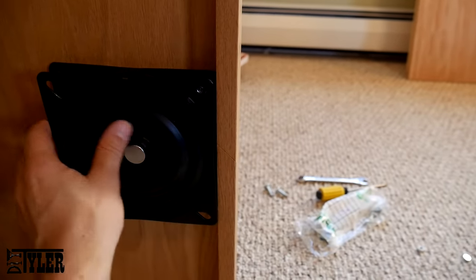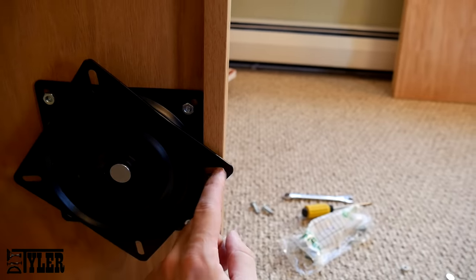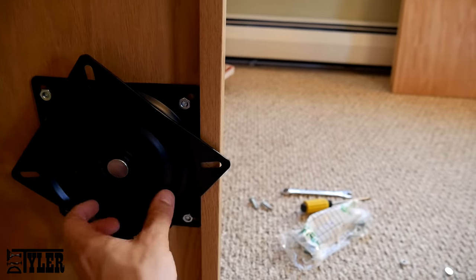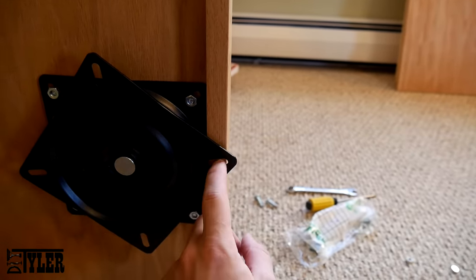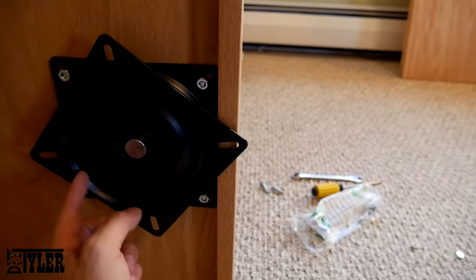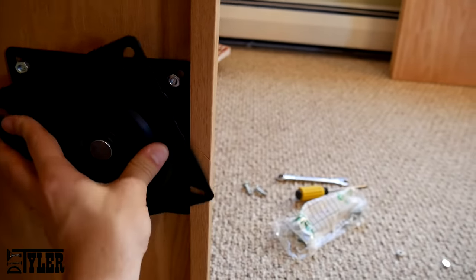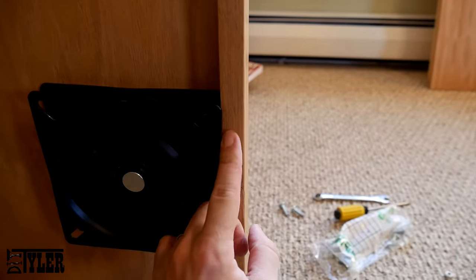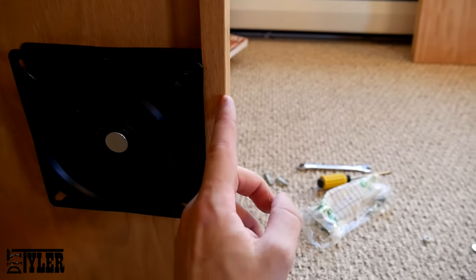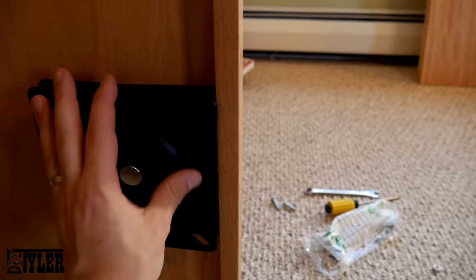Something I didn't catch in the design: when I got all the bolts in here, this is going to rotate over my trim and that's right up against it, so I can't actually rotate if I have this bolt in. You need all four bolts in this bracket to prevent it from sliding down when you try to tilt the bed up. So what I'm going to do is take a Forstner bit and basically dado out the back of this, two thirds or so, and pretty much all the way down so we can get that bolt in.